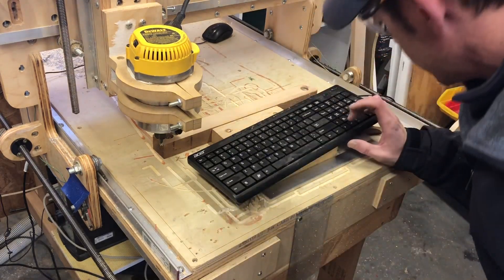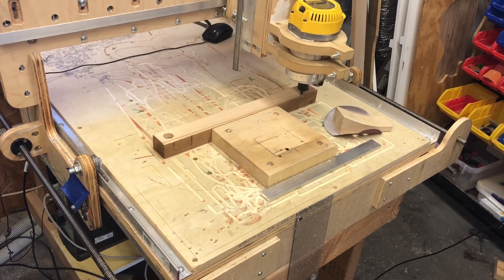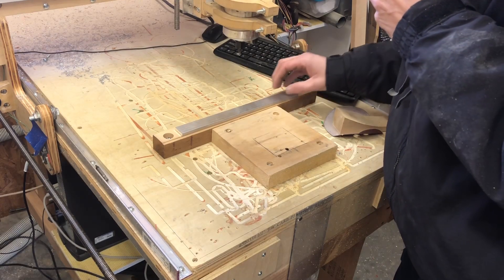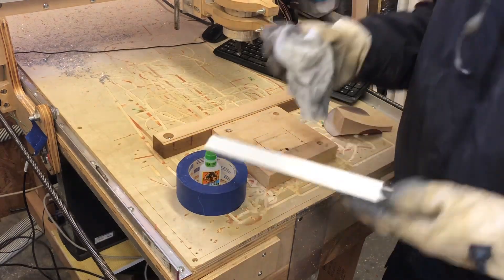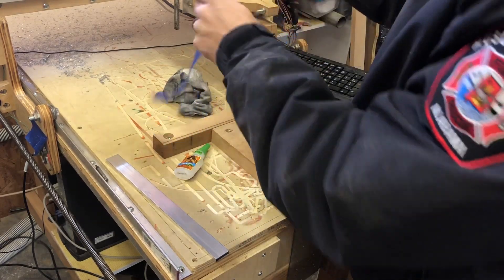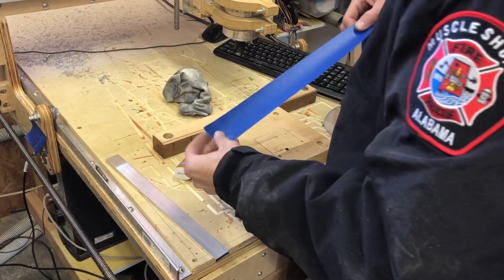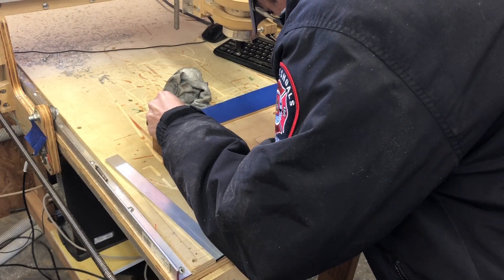You don't have to be very deep, just as long as it's aligned there. I'm going to cut it back on and run it across by hitting this button right here. Now I can align this with that line there, and as long as I'm close I should be alright — it gives me somewhere to mount. I'll use this on the back of the part to clean off any oil or anything like that. Usually what I do is take a piece of tape, stick it on there, pull it back off, and get rid of all the dust. Now with this one I'll actually try to be accurate and get it where I want it. I'll align that edge right here up with the edge we created on the part.